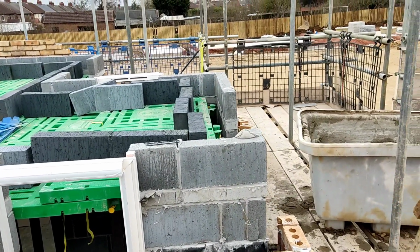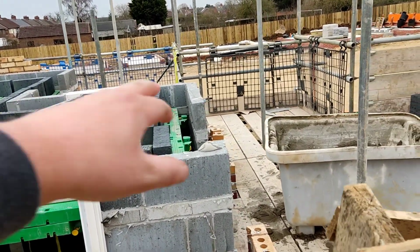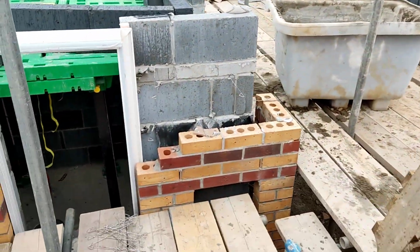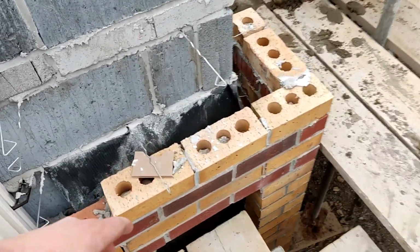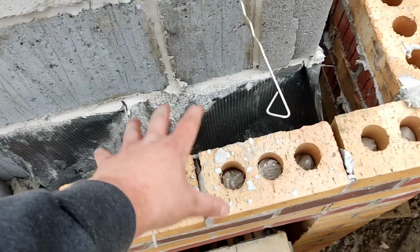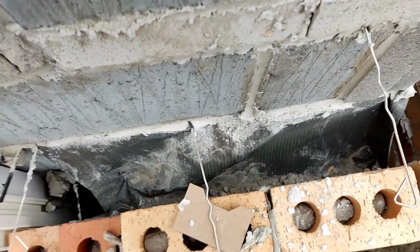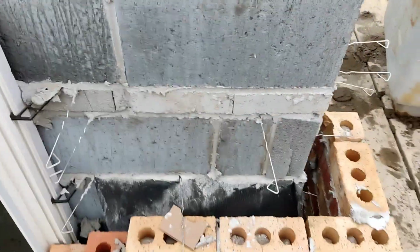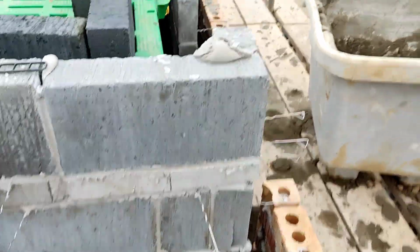Only difference is I'll have my 6 foot level on that side as opposed to profile. I've only got 2, I only bring 2, there's not much need to bring any more. Leave a little tip as well, leave a little brick out, put half, and then leave a brick scoping out to clean that. It's only a 1 metre box. Open cavities, obviously. No radon barrier.